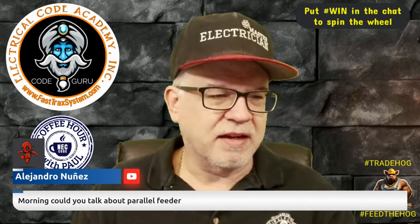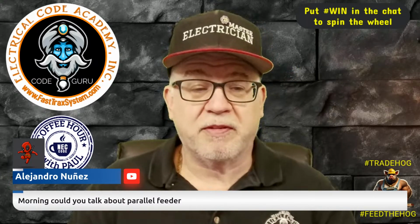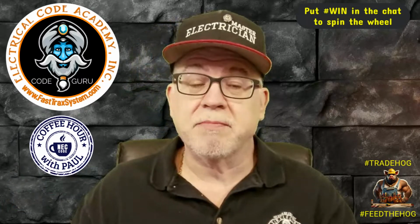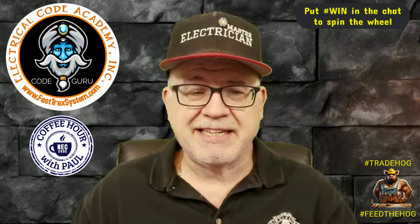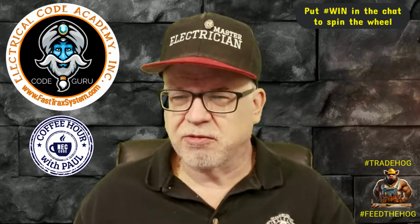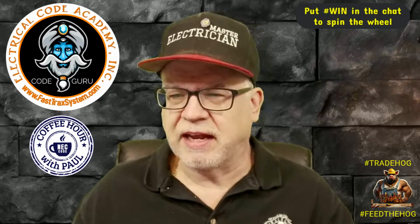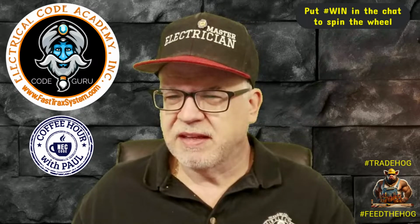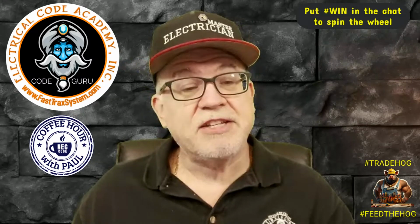Let's see. Alejandro says, could you talk about parallel feeders? Can you be more specific, Alejandro, when you're talking about parallel feeders? When you're installing feeders in parallel, you have to follow all of the rules for paralleling in 310.10(H), or I don't know, let me see here real quick. Is it H now with the code cycles? They change, and I have to check it just to see. 310.10. Is it H in the 2023? Is it G? It's G.